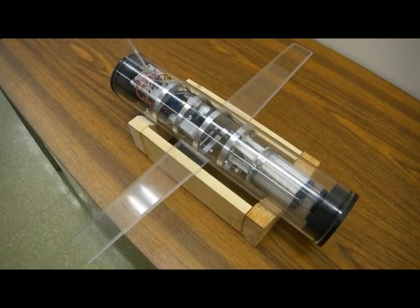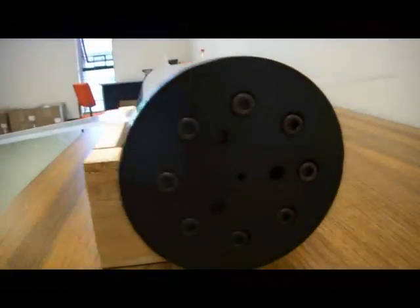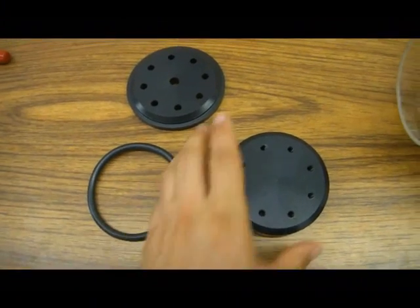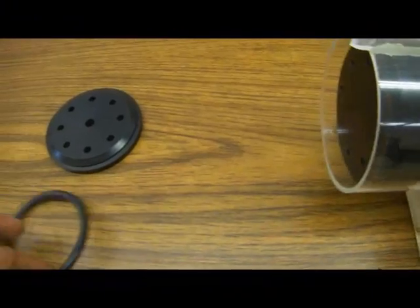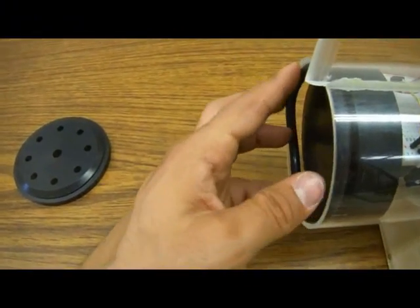The three syringes are sealed against the inner end cap. There's a hole going through the entire end cap for each syringe. Water is communicated through these holes to the syringes as the syringes are drawn back and forth. The end caps are made up of three parts: an inner end cap with a 60 degree chamfer for an o-ring to seat against, and an outer end cap with another 60 degree chamfer which then seats against the o-ring.